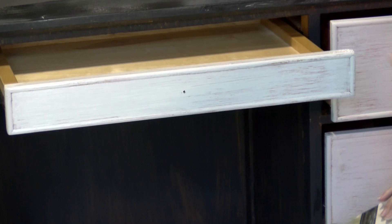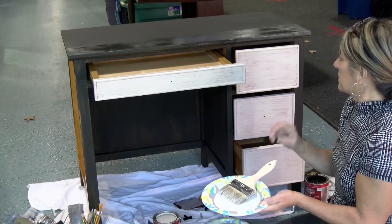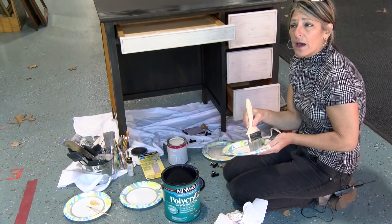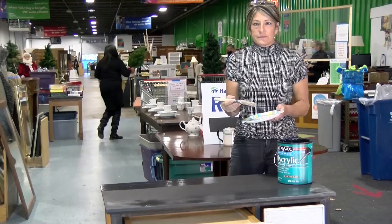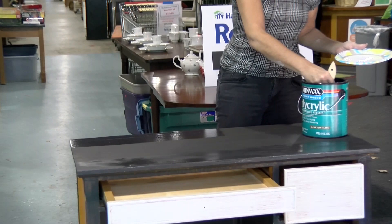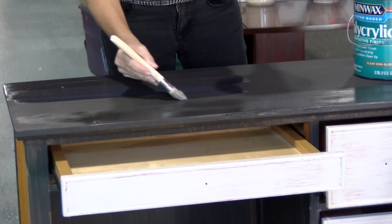You're going to do this process on the whole desk or your whole piece of furniture to protect it from scratching and marring. The benefit of using Polyacrylic from Minwax is it's water-based, easy to use, cleans up easily, and it doesn't yellow. As you're applying the final finish coat you'll notice a milky finish while painting it back and forth — just know that it will dry clear and you won't see that whiteness.